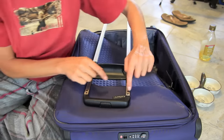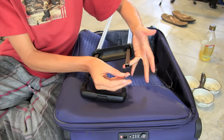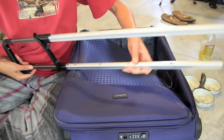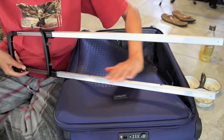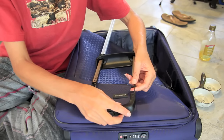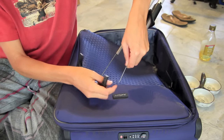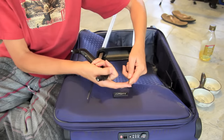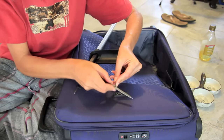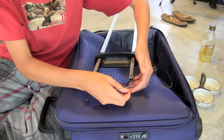So now I've got this bar out, and I've taken out the screws here and here as well, so I can trigger this out like that, revealing these pushes. When this presses down, these get pushed down, which makes these little knobs go in and out. When they're in it can slide down, and when they pop out they lock in different positions. But one of them's permanently locked in, because they're stuck up in these holes. I yanked this one out — it was very, very hard to get out, which meant it was catching, so it wasn't free to slide. When I felt over it, it was very obvious it hadn't been finished properly, hadn't been sanded or anything. Whatever luggage company makes a different version that actually works could make a fortune, because this is such a common issue — people throwing their bags away because they can't figure out how to fix this mechanism.